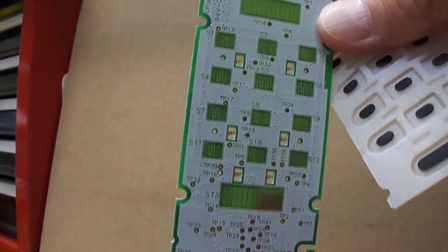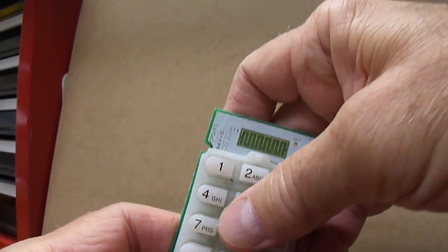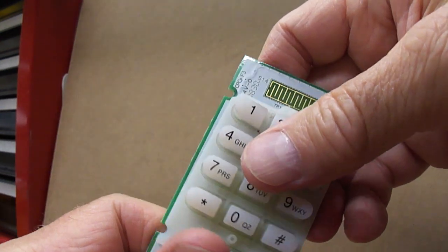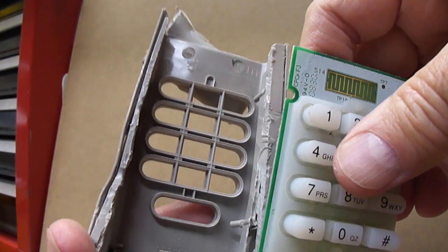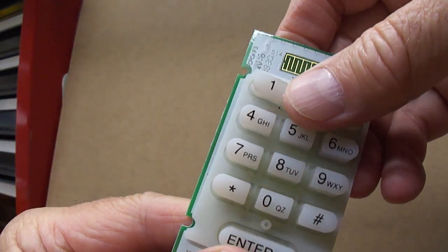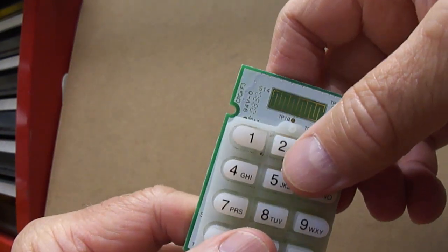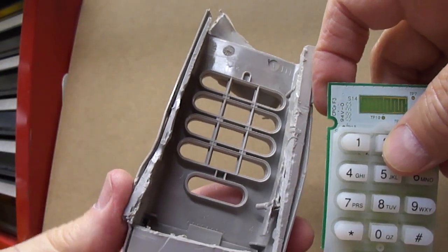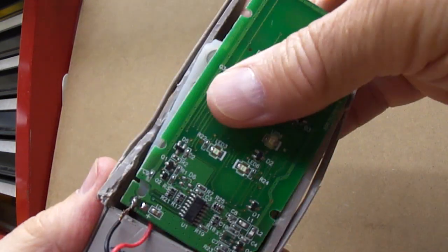Again, I took this apart now. I busted this thing apart to get it open so I could show you the circuit board. And that's another fact. When these things are set to operate, there has to be a continual pressure pushing these onto the circuit board, otherwise it won't work. So when you cut these open and you can't fasten them back together carefully, the pad probably will not work. If you have screws holding a cover on like you do, or sometimes with the remotes for TV where you just snap it together, that's fine. But this one here, if you cut this open like I hoped to have been successful, I probably would have had problems, because you have to have pressure on the back cover to keep this together.